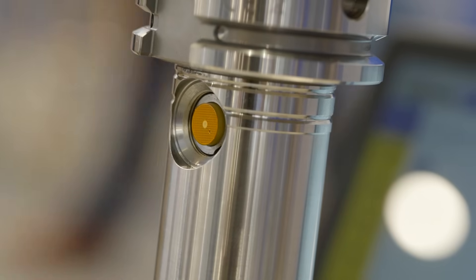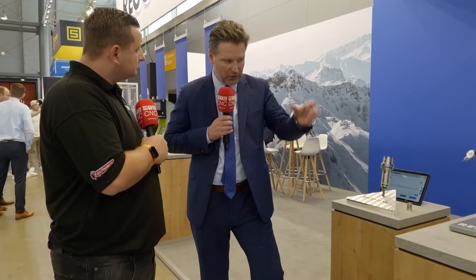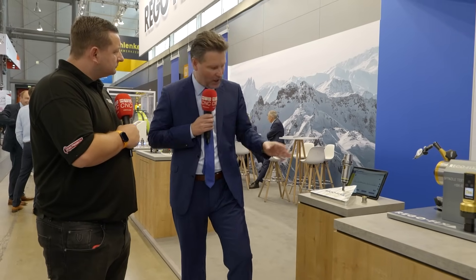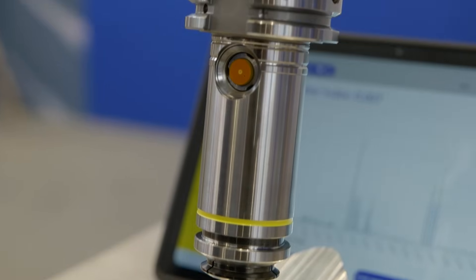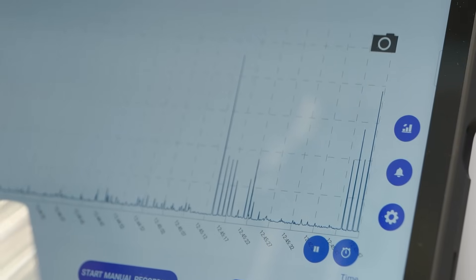And what about the spindle? Because obviously if there's a problem in your machine — cooling, tool holders, even tooling is always the first to get the blame. So how does this help customers looking into the right solution? It's a good point. You can also use this tool holder in the idle mode of your spindle without even being in the working process. You could check if your spindle has some vibration issues, or think about an automatic tool changer. If you grab that tool holder from the magazine and bring it to the spindle, every time there is a certain shock you could detect that. So this gives preventive possibilities to check whether your machine, your ATC, your spindle, and your process are doing right.